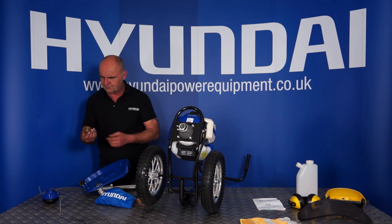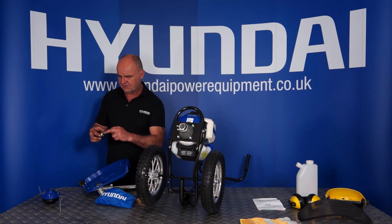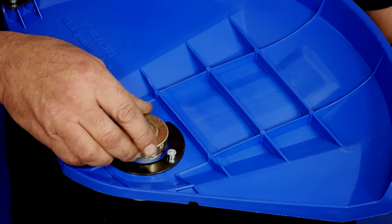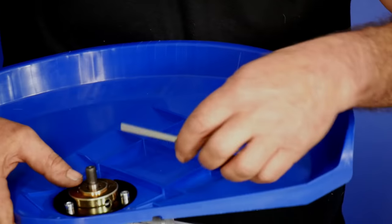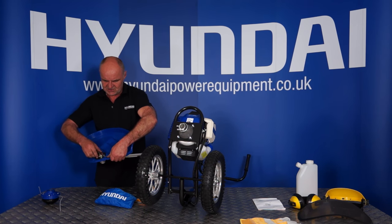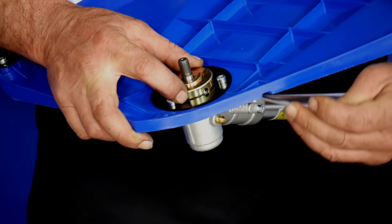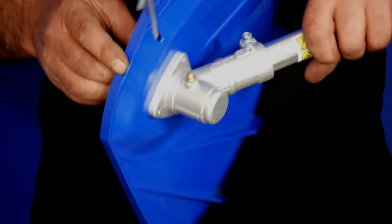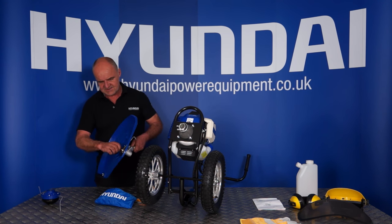Before we fit the trimming head, we need to fit the drive ring. You'll notice that the drive ring has a cup on one side and one hole around its perimeter — this hole is quite important. In the head itself there's a slot. When we fit this cup side down — not upside down, cup side down — that hole will line up with the slot. The way we lock the shaft off is by placing an allen key in the slot, which locks the whole thing so it can't rotate. If you've got it in the wrong orientation, just rotate it around. You can do it up through this hole when in use — into the hole, rotate to get the hole to line up — and it locks in place. Once locked, it cannot rotate.